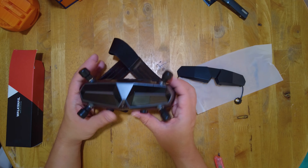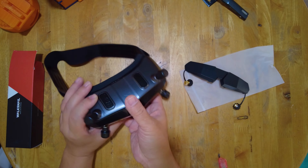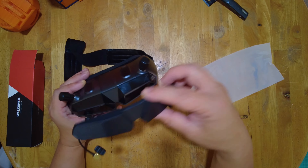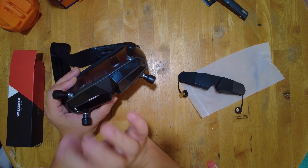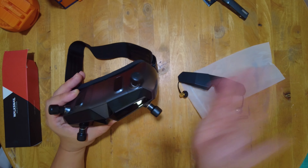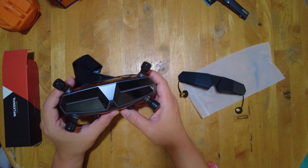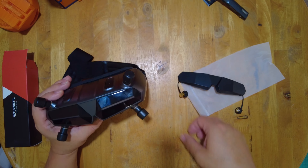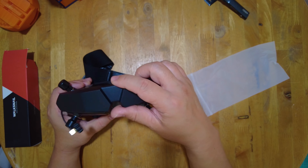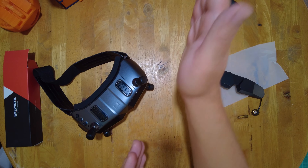The stock front plate of the Goggles X lights up when you plug in a battery. This one is removable, so you can replace it. And this is a patch antenna — a patch antenna just has a forward-facing beam, unlike these omnidirectional antennas where you can fly all around to the side, to your back, and still get good reception. You can get good range on these stock antennas as well, but if you're really interested in going long range, you probably want to have this patch antenna. It's supposedly going to make the beam width narrower, which means you can fly longer because the signal goes farther.